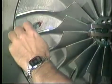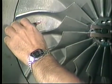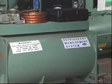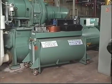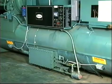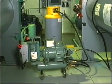If the machine is relatively old, replacement may be the best approach. If it's relatively new and is in good condition, containment will probably be the most economical approach. There are many products available today that serve the containment task. They include refrigerant transfer and storage equipment, leak detection devices, relief valve backup for frangible disks, pressurization equipment for shutdown conditions, high-efficiency purge systems, refrigerant recovery systems, and others.